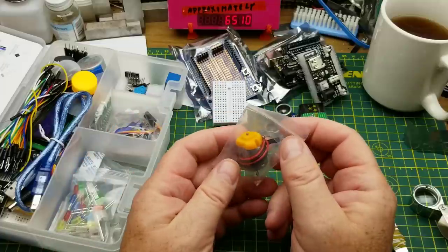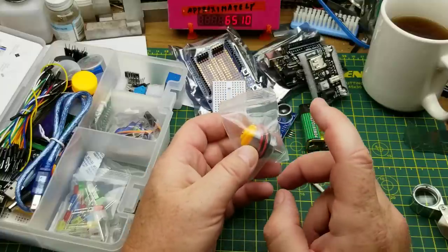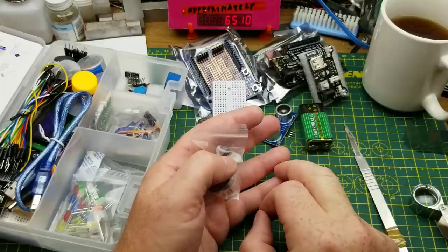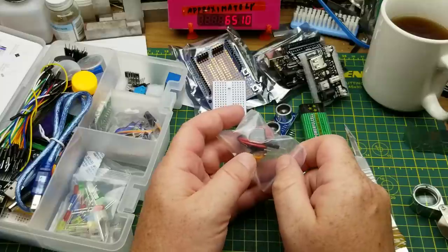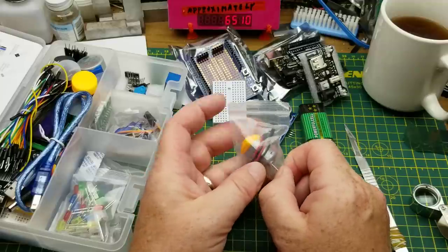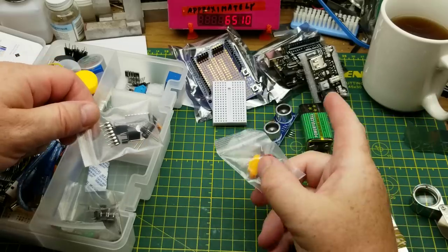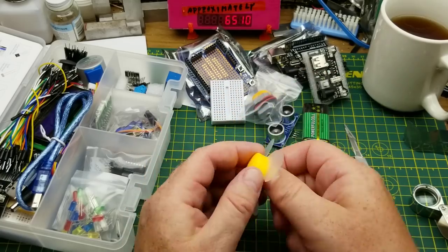We have a plain old DC motor. People ask me often what starter kit to look for — I always tell them to find one with as many different types of motors and as many ways of getting inputs and outputs as possible: I2C, SPI, analog inputs, digital inputs. For this DC motor, you probably don't want to run it directly off an Arduino pin as it may pull too much current, so you'd want some kind of driver. There are a couple of transistors in the kit, and I also see a fancy little fan blade that goes onto it.